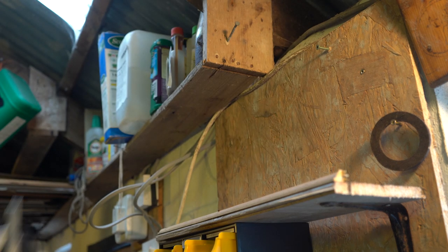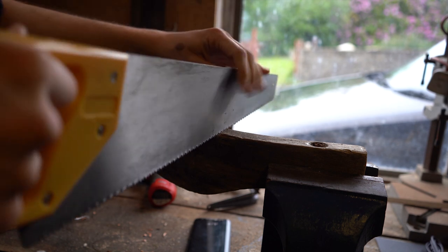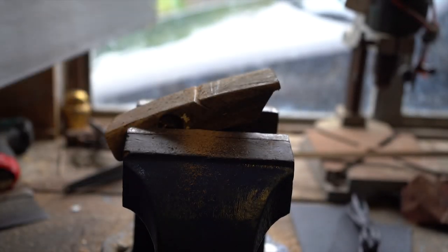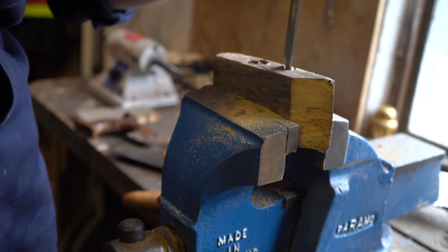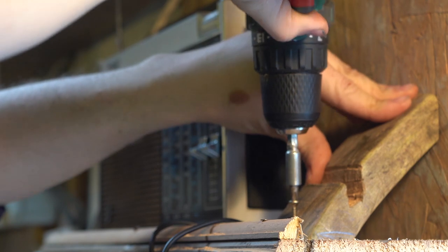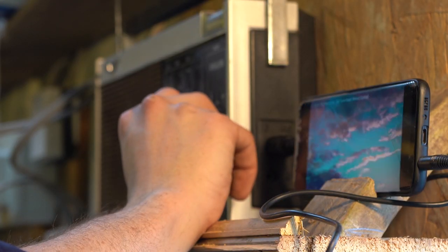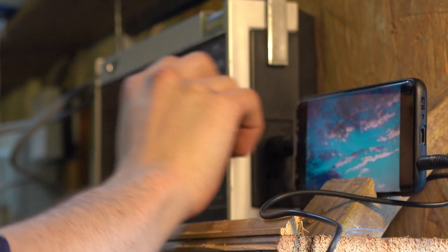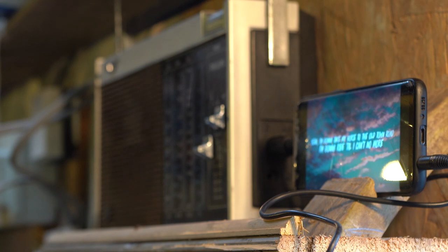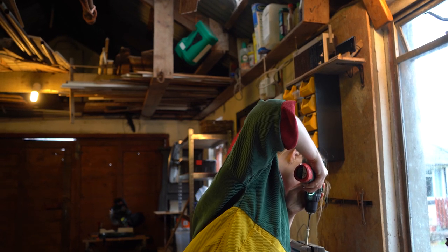I still felt something was missing — I needed a little cradle or phone holder so my phone or MP3 player had somewhere to sit. I took a length of wood from my wood drawer — actually from an old barrel I found on the shore a few weeks ago — and cut and rasped away at it to come up with this little holder. I put holes in the back to feed in wires and charging cables and the 3.5mm jack, but the wires pushed the phone out slightly. I find I actually prefer to keep my phone on its side when playing music, since I often watch YouTube videos or long-form podcasts in landscape mode. It's there if I need it, and I might find it more useful with other devices. Screwed it into place — I think it looks pretty elegant, not bad for ten minutes' work, and it acts as a neat further support for the shelf.